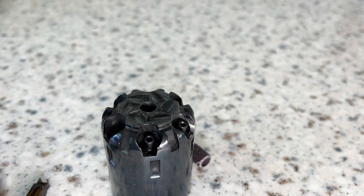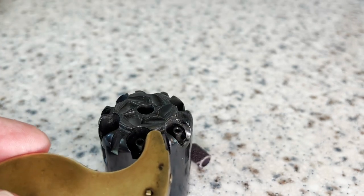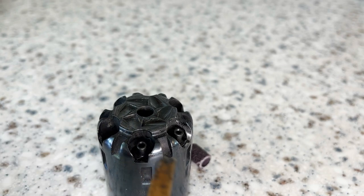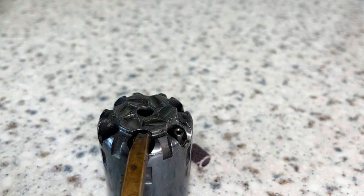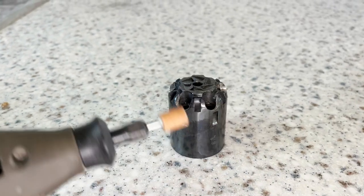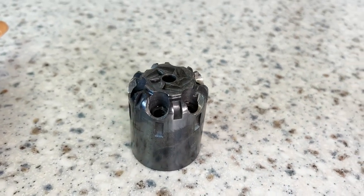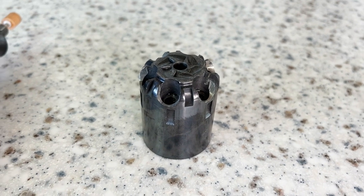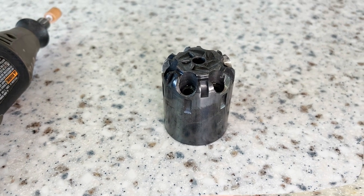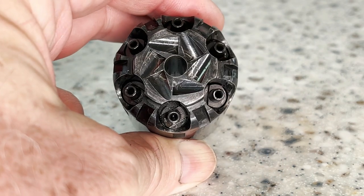The next modification I want to do is to open the ports around the nipples. This pistol capper will not fit down into that area to put a cap on the nipple, and neither will a straight-line capper. Even putting caps on the nipples with my fingers is very awkward and cumbersome. I used a grindstone in my Dremel tool to open the ports around those nipples, and now both styles of cappers will easily fit into that area. The only thing left is to polish that area and re-blue it. I have it all polished, the nipples installed, and the cappers fit very well.